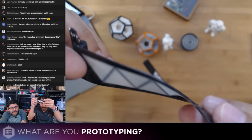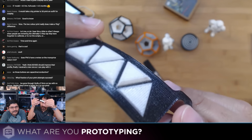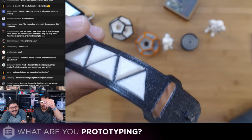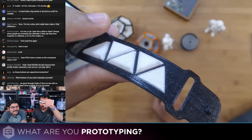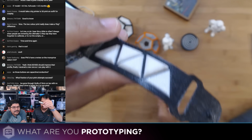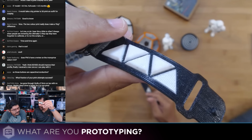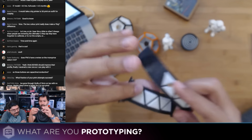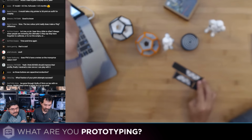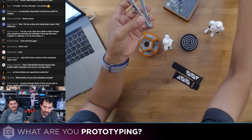Did a really good job on that. Well, there's maybe a minor bit of contamination, just a teeny bit. You can live with the contamination if it's actually able to print it. Because on the Ultimaker, all we could do is the Semiflex or the Cheetah filament, or their very own blend of TPU, which feels very much like Cheetah. But on the Sigma, you're able to print all of it. And again, it just goes to show that it's per model.